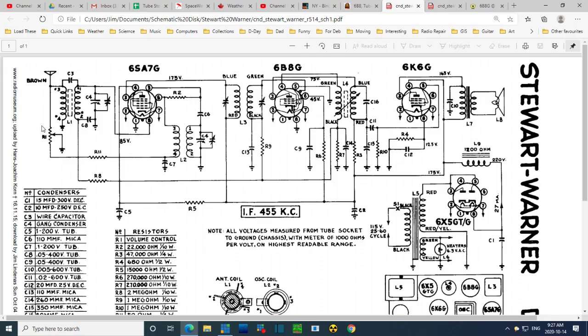The reason I'm curious about this is because the volume control is a weird operator. You turn it about 1/3 of the way, nothing much happens, and all of a sudden everything comes to life. It's really a terrible volume control. I'm wondering if it's something to do with this. It's affecting the local oscillator strength. I don't know. They try to set this up so strong signal meets strong local oscillator. I don't know. Something very curious about how all this is done. Curious to me anyway. C6 is probably a very small capacitor. 110 pico.